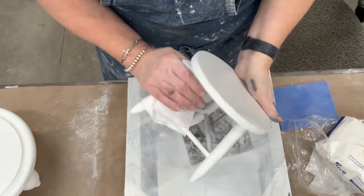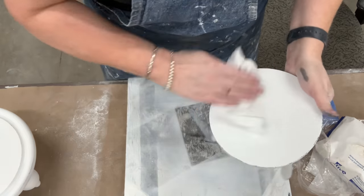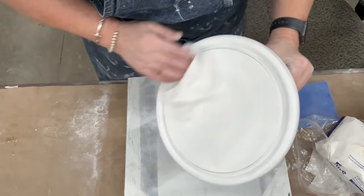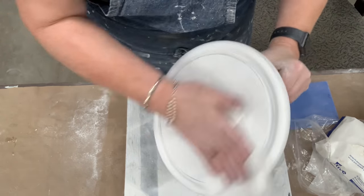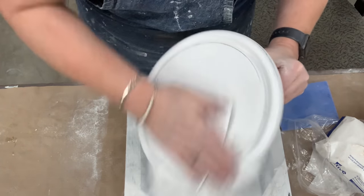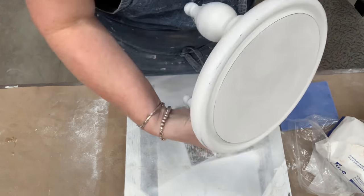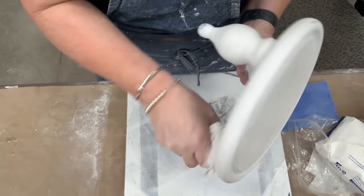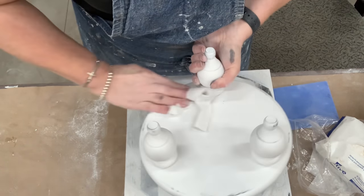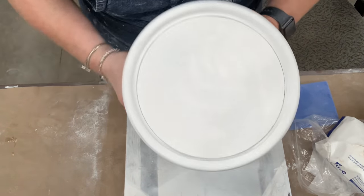And sometimes when I am doing a grouping of similar items and I'm out thrifting and I run across another item, I definitely get it done while I'm doing that grouping, like that little stool was. Now to get these a really smooth finish, I'm just taking a wet wipe and going over the entire piece. I've already sanded them, I've shown off that black, and if I wanted to distress a little bit more, I can push a little bit harder with that wet wipe, but I love the smoothest I can get by taking a wet cloth to this chalk paint.